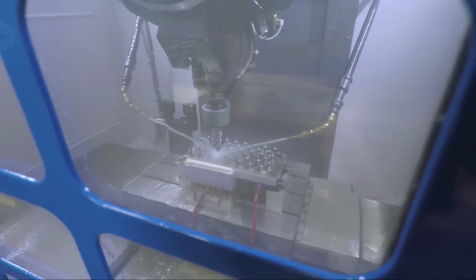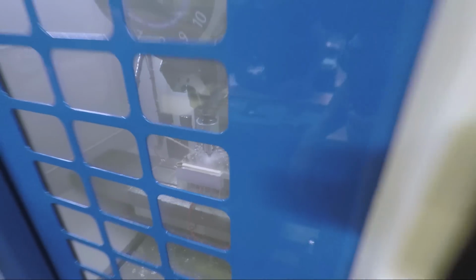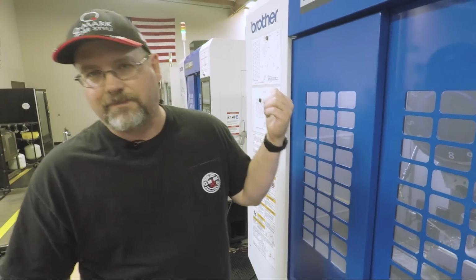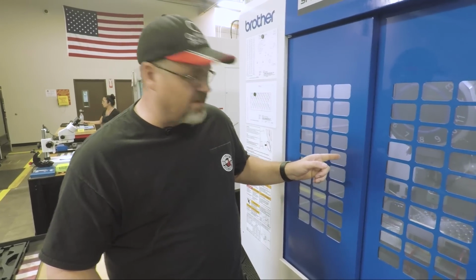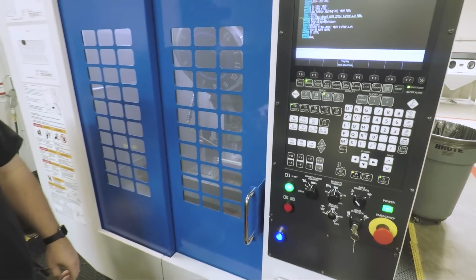Is it doing interpolation there? Right, we don't actually drill the holes. We're grinding them in a helical motion, with an abrasive, not a cutting tool. With a diamond. Interesting. I'll have to get one of the diamond tools to show you. It's essentially the same as a grinding wheel, a metal bond diamond matrix little tool that we use. And that's a 50,000 RPM pneumatic speeder. Insane, 50,000. And we run oil on all these machines. Is oil your coolant? Yes, synthetic oil is coolant.